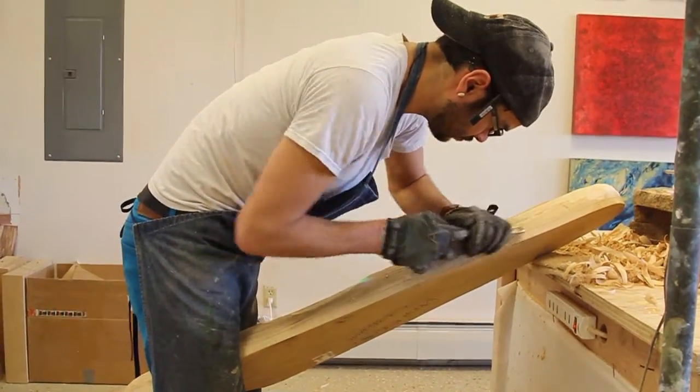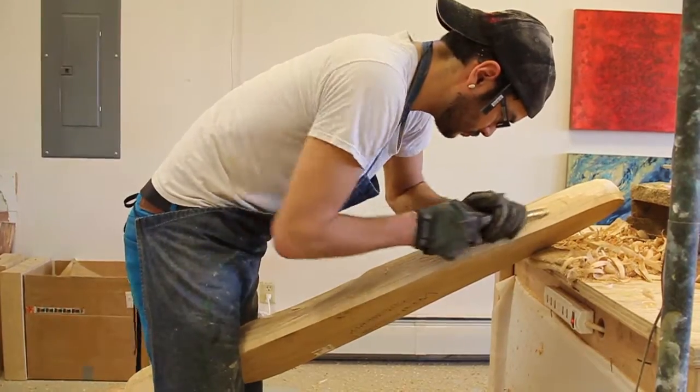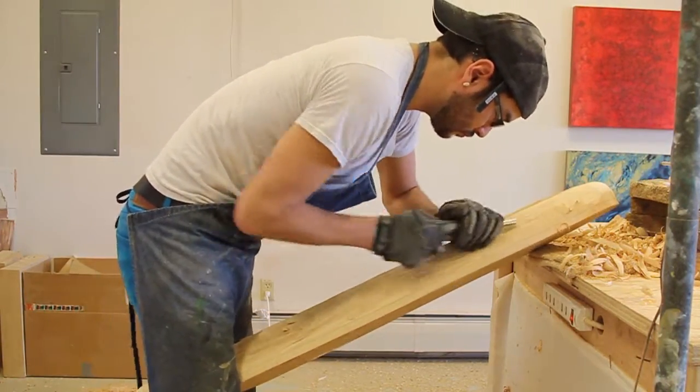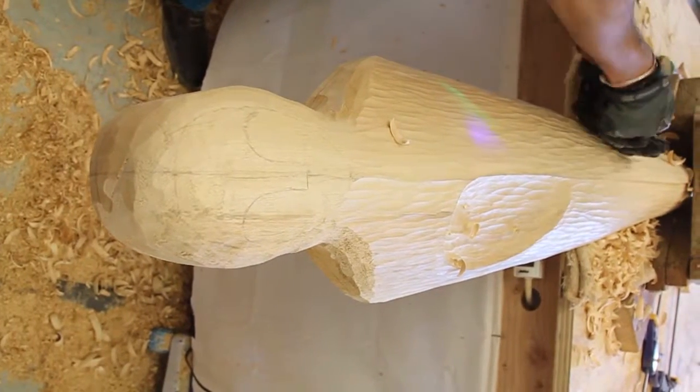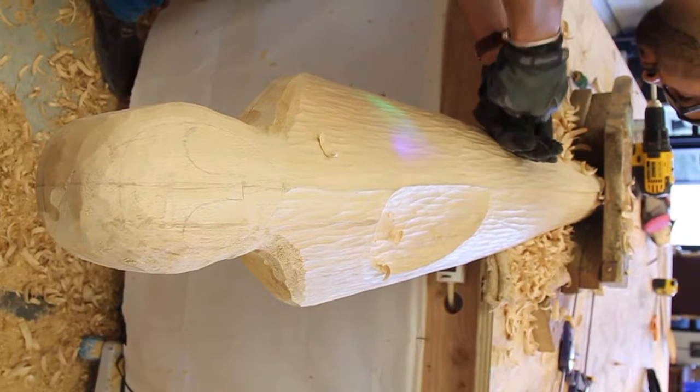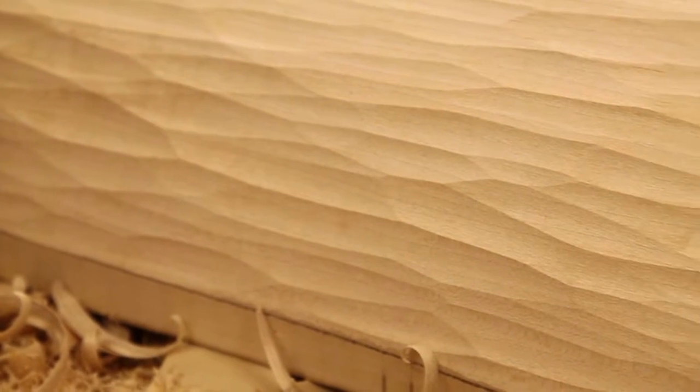To me, if you're going to sand a piece down a lot, it looks a little bit not like wood after a while because you're making it so smooth, and then typically people paint on their masks. But what I like to do is make stains so that you can see the grain of the wood along with the gouge marks.